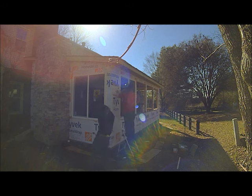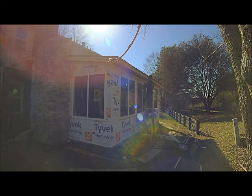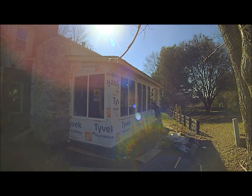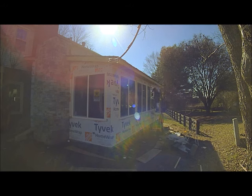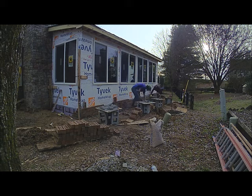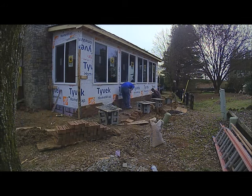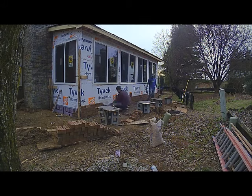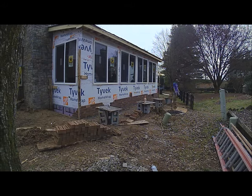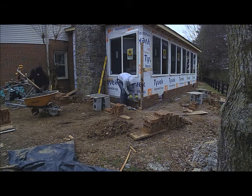Now installing the windows — these are five-foot by five-foot sliding windows. We put house wrap — Tyvek, there are several brands — on for waterproofing; it's required by code. Pretty easy, just staple it on and your siding goes over top. Underneath the house wrap is plywood sheathing — only half-inch or seven-sixteenths inch — which is what your siding nails to, though you still want to hit the studs with your siding as well.